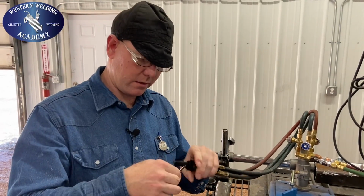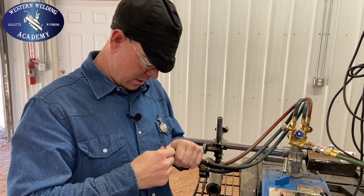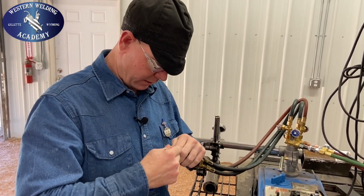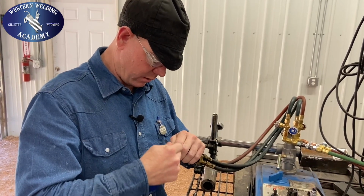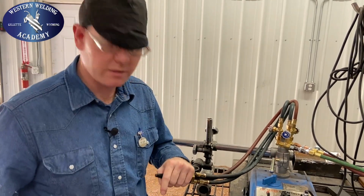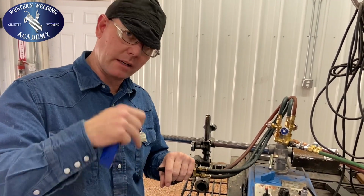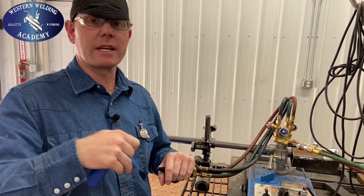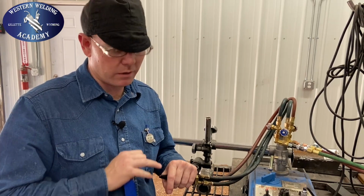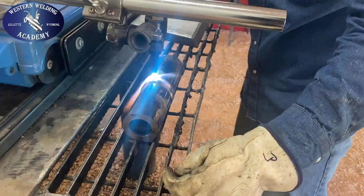Okay, just like always, we start out by cleaning our tip on the torch. I got the bottle set, 5 on the acetylene, 40 on the oxygen. We get a nice clean tip on here so we can get a nice straight cut on our coupon. I'd like to have a spare file hanging around here, just an old junker you can stick inside that pipe. Sometimes when you're cutting through that pipe, it'll heat up the other side, and it seems like inevitably, it gouges out right over your bead where you need to bend at. You don't want any gouges like that across your bead that you got to bend.